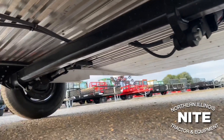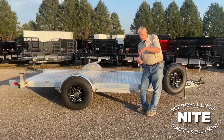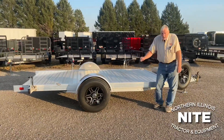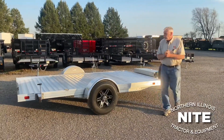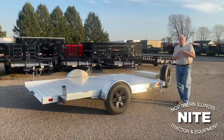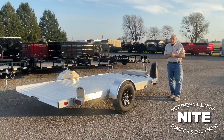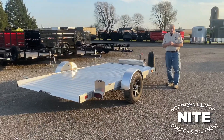The spindles are offset from the center of the axle beam, and around precision bearings this whole axle is rotated by two hydraulic cylinders. This trailer is now rated at 5,000 pounds, so it's going to handle your 2,500 to 3,500 pound scissors lift. This will be ideal to load scissors lifts and other difficult-to-load machinery.